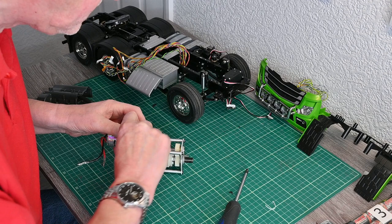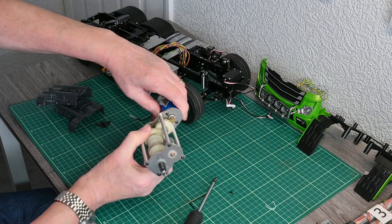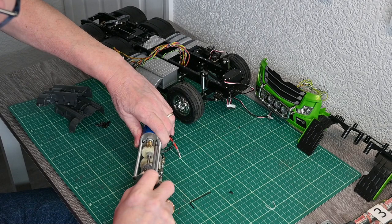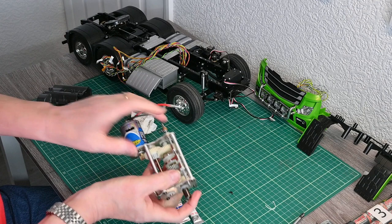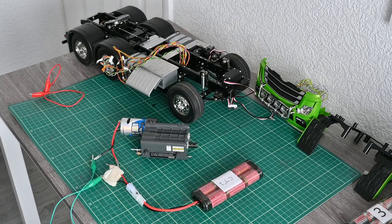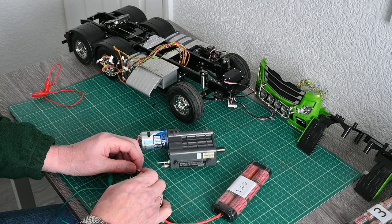Set it up to where I want. Don't put it too far forward because there's another cog behind — another set of teeth — which can catch that white cog and make a mighty clattering noise. Just to adjust the tension between the motor and the drive gear — not too tight. Put it all back together, get some grease this time. I'll give it a check on the bench — this is a voiceover so you won't be able to hear it, but you will see it move. Applying about seven volts to it just to check it works and it drives the gearbox — excellent.